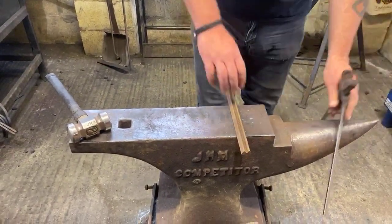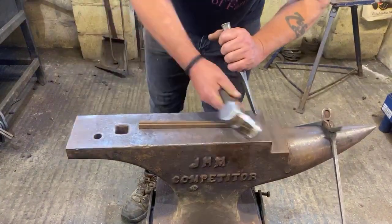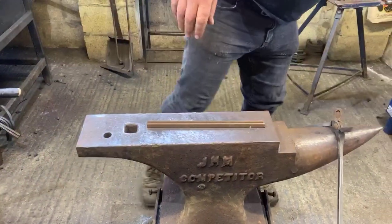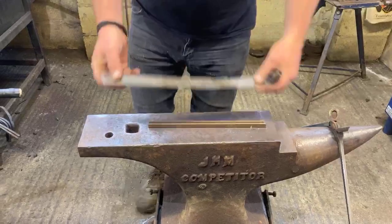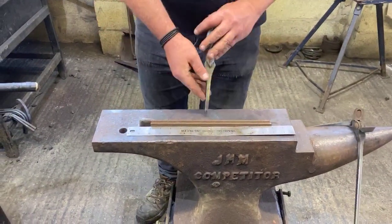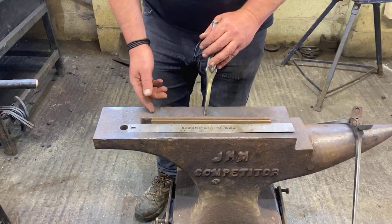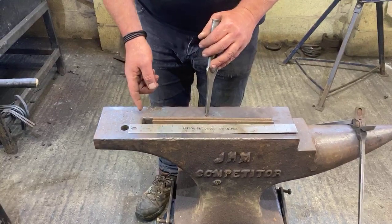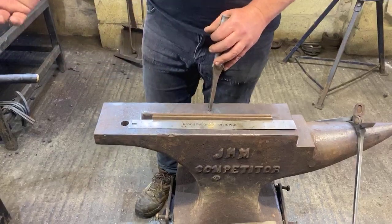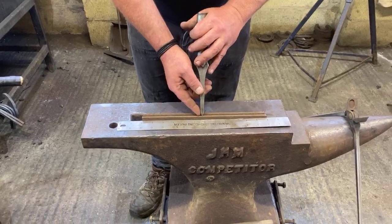First thing we're going to do, we're going to mark this, like I said, if you remember which one's going to be the lateral heel. It's really important, you don't want to be making the wrong side on a job like this. And again, obviously, we always mark off center, so we've got a shorter inside branch, but because we're going to run it up and forge it quite a lot, we're going to gain some more. So, and because, like I say, we're coming underneath the foot, we're taking a shortcut, so I'm actually going to mark this a whole quarter of an inch off center.